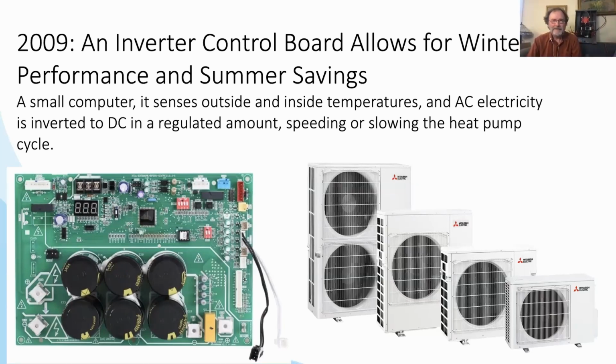Oh, sorry, I missed that. Well, so the question is, I'm saying, do these ground source heat pumps have lower startups, lower kick-ins, because I see those on the air source. I see the startup, it can be high, especially in winter. Well, on the inverter-driven machines, when I've got my meter on my inverter-driven mini split air source, the startup's nice and low. So the inverter-driven machines have a low startup. They're converting AC to DC. They're not having this big power surge that people associate with AC machines kicking on a single speed model, that big loud bang of your neighbor's air conditioner turning on. They don't have that. So I don't see really a difference in the ground source versus air source. Once you've gone up to inverter-driven machines, then everything's fine.